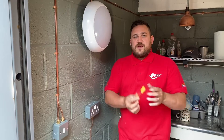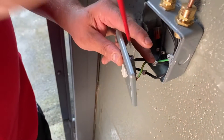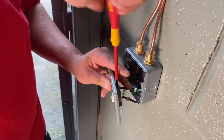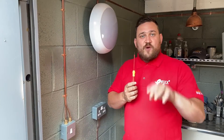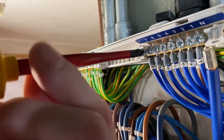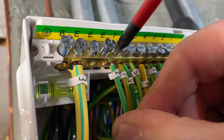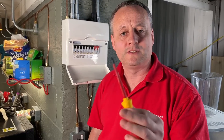However for light switches we need something like a 3.5mm flat head screwdriver — perfect for doing up the terminations inside a light switch, and I'm also a fan of using this for the box screws on the front of these accessories. In order to tighten the connections within the consumer unit, I'm going to use my slotted Posi 2 screwdriver, not the Posi screwdriver we saw earlier. This screwdriver is used to tighten up those terminations but not to the required manufacturer's torque setting.